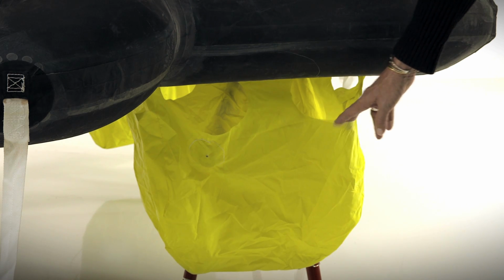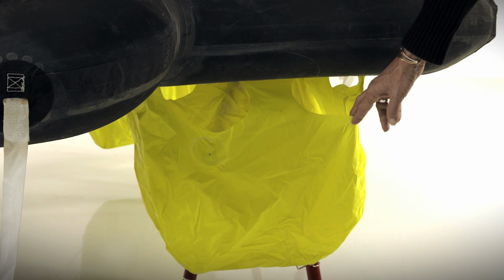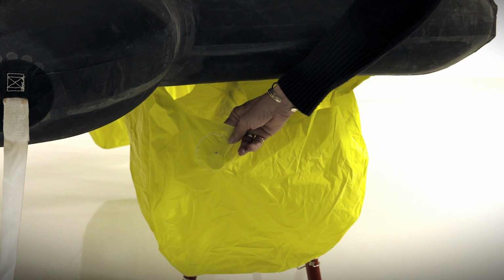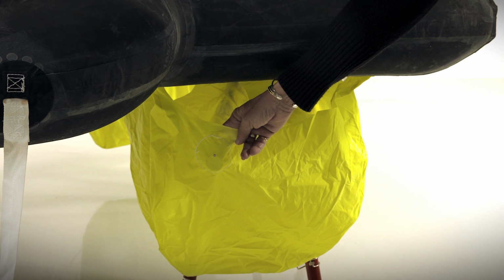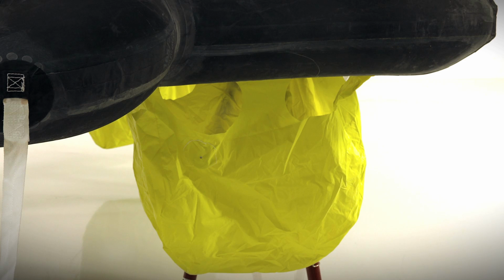Beneath the life raft, you'll find 4 large ballast bags. They have large openings around the top so that they flood quickly, along with weights in them which aid in sinking the bags into the water. Each bag will hold 16 gallons of water or 60 liters. This is going to create 650 pounds of ballast or 300 kilos.